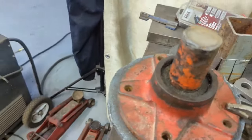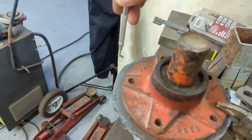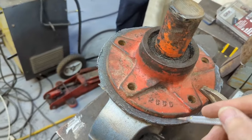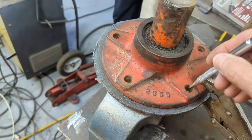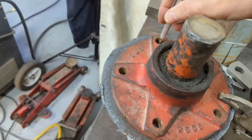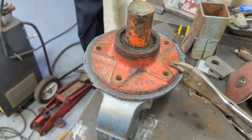Well, this is kind of what I was looking for, but I'm not super happy with this particular one. I thought I was cutting it large — it's very hard to do a cut like that freehand. I should have had a better jig to go around. Anyway, this will work for one end; it doesn't have the locking mechanism on it, so the next one I'm going to have to do much better. What I've done is clamped them together and scratched through all the bolt holes, so we can go over to the drill press and drill some holes in there.